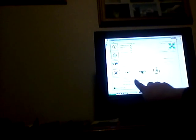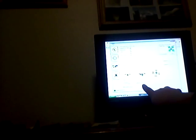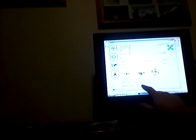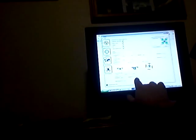Okay. So this is your compass value down here. This is the information that's being sent out from the compass. And your pressure sensor, the barometer, and it tells you the temperature. Okay, so it's 27.45, 47, 48, it's rising because I've got heat near it. Degrees in Celsius and the height estimated. And it's 0.3, 0.4. Well, it's going up because, of course, my temperature is going up.